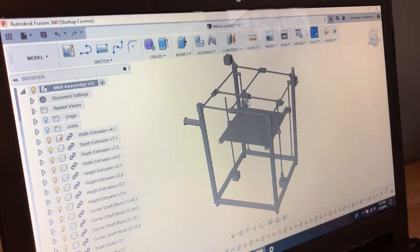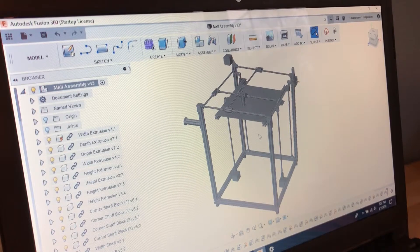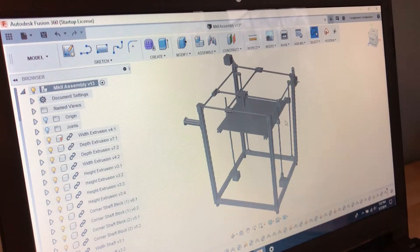Since the x and y axes are at the top of the machine, the bed has to move up to it. With this configuration, the home position will have the bed up at the top of the machine, and as the print continues it will slowly move downwards. The primary problem with the previous 3D printer was its use of v-slot wheels — this new design doesn't use any v-slot wheels whatsoever. The other big problem was the heavy gantry causing y-axis movements to shake the machine, and this x-y axis design should remedy that.